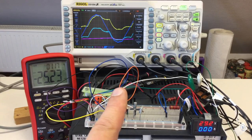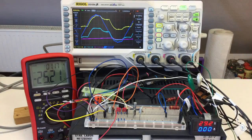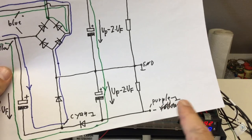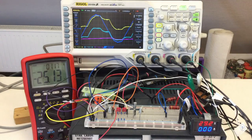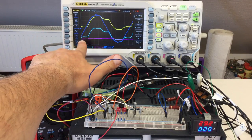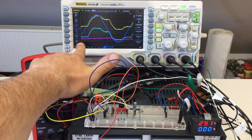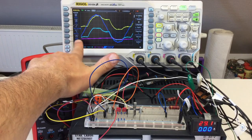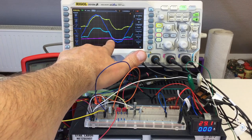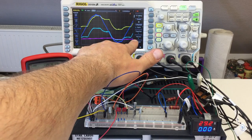Back to the oscilloscope view. We have our output voltage — the negative rail — in purple. It follows the normal rectified and filtered curve. As it discharges, being a negative voltage, it nears our zero line. When it's charged again in the second cycle, it discharges again. The blue line is our AC input as the other reference.